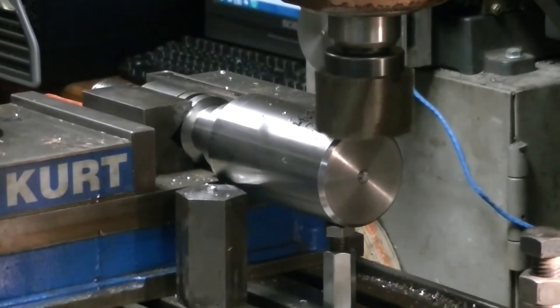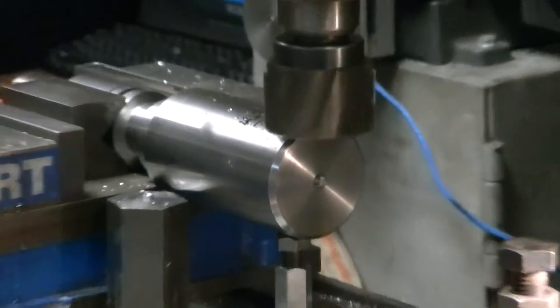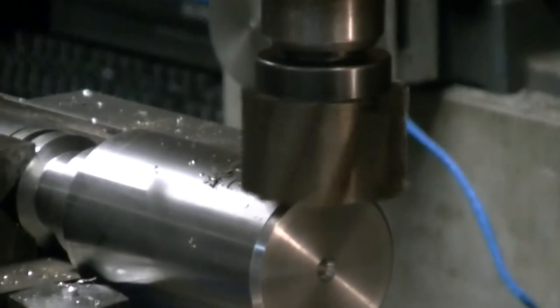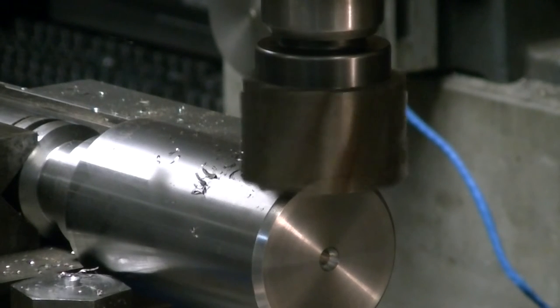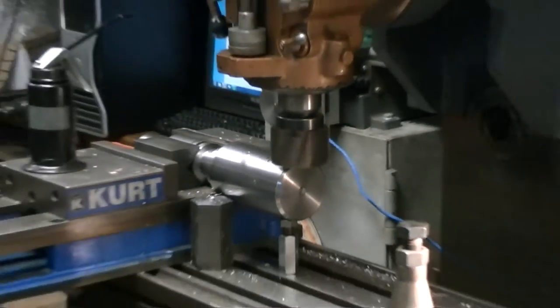The drive head is a hydraulic motor that drives it, and it's got a 2-inch square receiver that drives whatever, whether I'm running augers or the core barrel. So I had to machine this round into a square to fit up into the hydraulic drive.